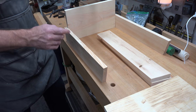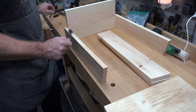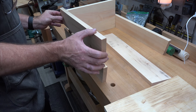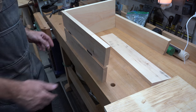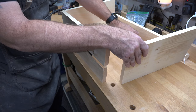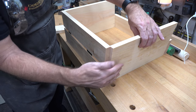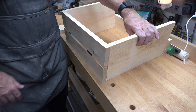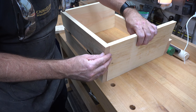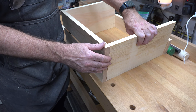Those are the main components needed to assemble the main body of our wagon. The shorter pieces go on the bottom, then there will be a half-inch gap — I'll use a couple of spacers for demonstration — and then your top slat sits just like that, and our beveled board will be glued into place to form the front of the wagon. We're going to glue this crate together, and I'm going to shoot a couple of brad nails into it to hold it in place.